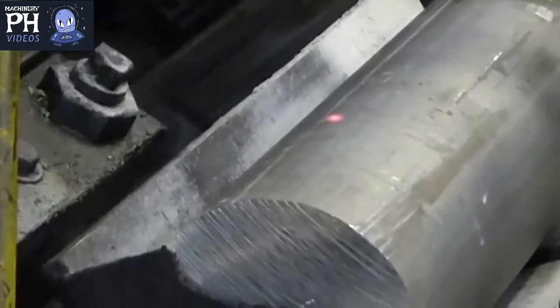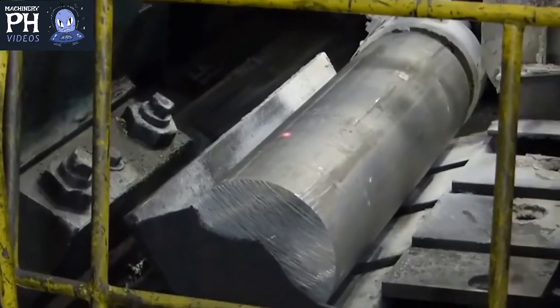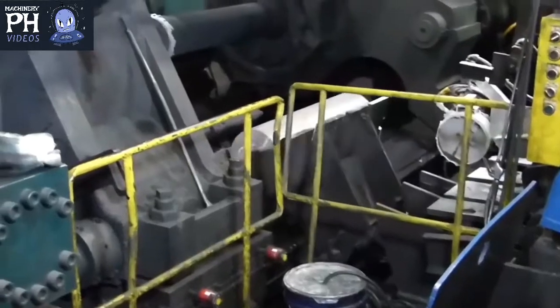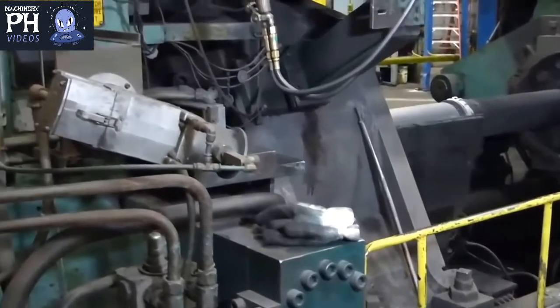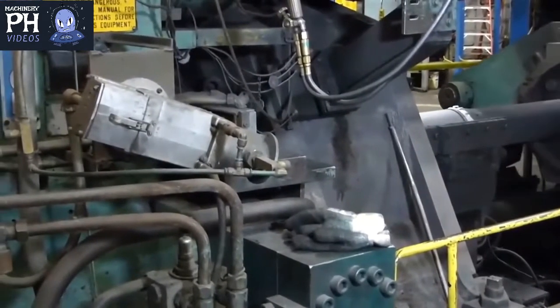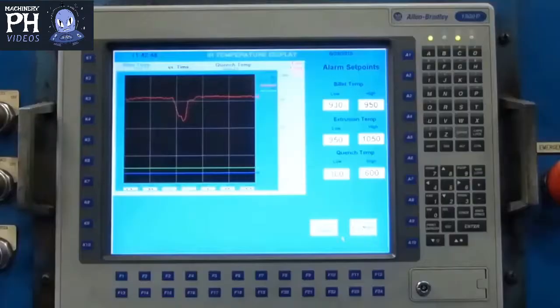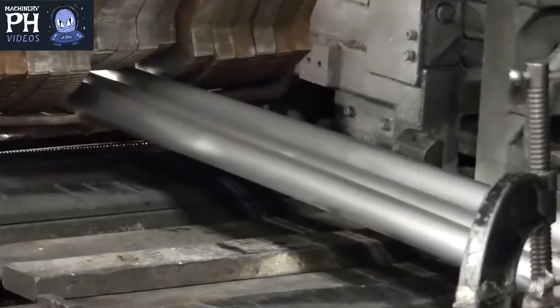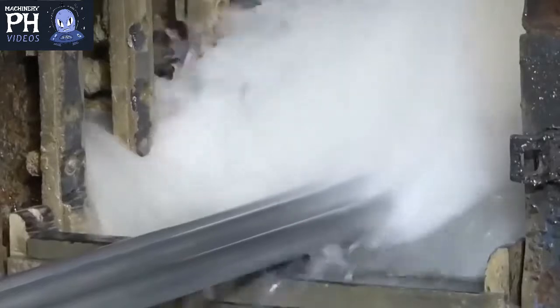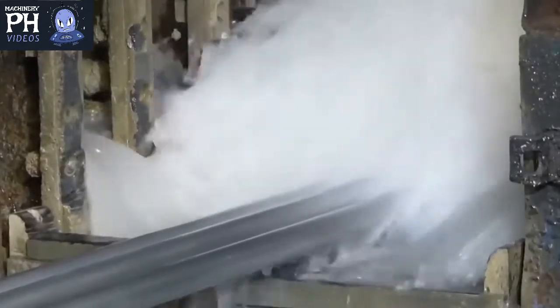We've already discussed the heating of the billet to a malleable temperature, but you should also know that the container, extrusion die, and other support tooling are also preheated to temperatures that allow the aluminum operating temperature to be maintained at desired levels throughout each push. If these process components aren't precisely controlled within their specified temperature ranges, the operating temperature of the aluminum will be impacted by those components, either by adding to or absorbing from heat required for solution heat treatment.